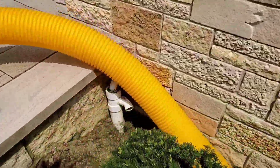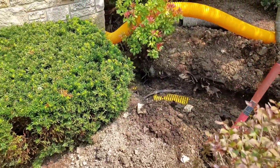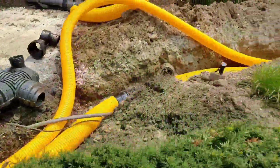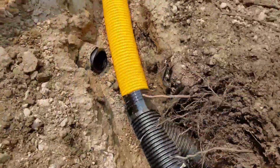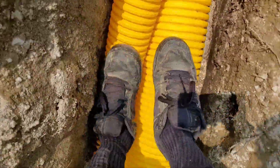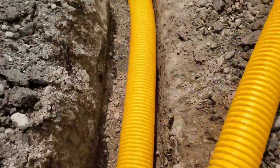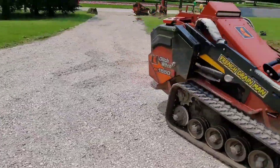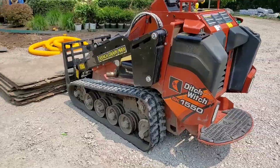What do you do when you're going to be driving over top of your drainage system? I'm going to show you a sump pump discharge line ran in the same trench as a roof runoff system. We have a six-inch pipe for the sump, and then we have a four-inch pipe off of just one of the downspouts in the front of this home. We have many downspouts, and a six-inch trunk line that all those four-inch pipes are going to tie into.